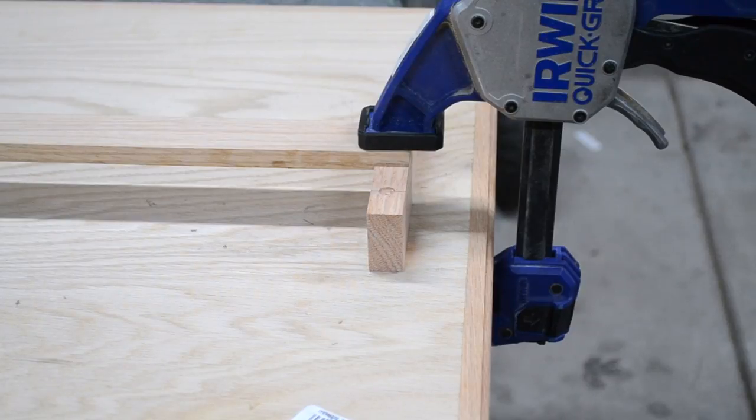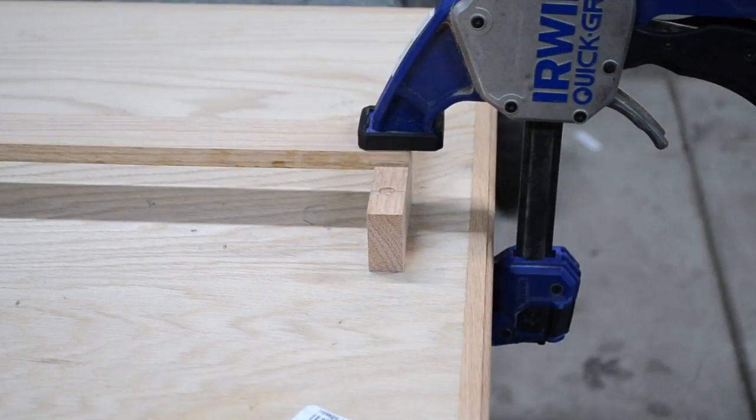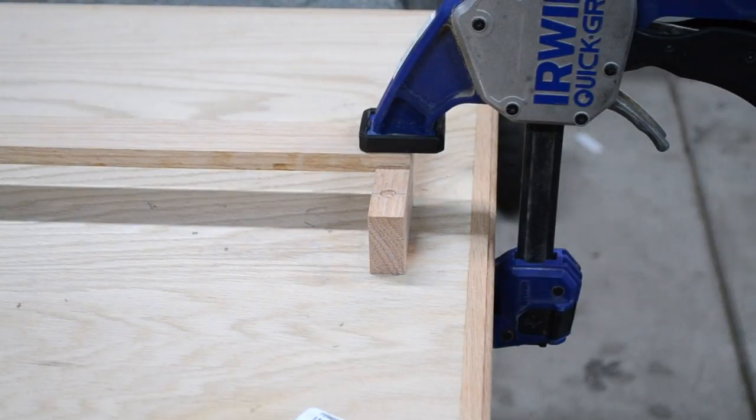Now I have everything set up for the pre-mockup stage. I'm using the screw that has already poked out of the other side as a reference to exactly where I need to go. Since my measurements were in the dead center, all I need to do is measure 12 inches from each side to get a standard point. Then I'm going to measure in an inch and a half to this point right here using the plywood — an inch and a half in, not the outside trim. After I clamp down the cross brace, all I need to do is pre-drill my holes so I can put the screws in. Since it's clamped, I don't have to worry about it going anywhere. It's already screwed in place and because it's routered to overlap the piece of wood, I don't have to worry about it twisting on me.